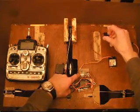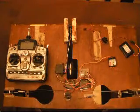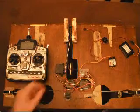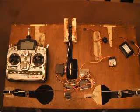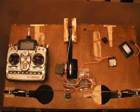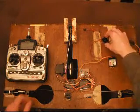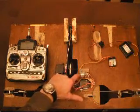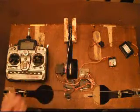To start the setup routine, turn off the power, press the button, turn on the power, and release whilst it's still beeping. To select option one, press the button following the single long beep. I missed it initially, so I had to try again. To select option two, press after two long beeps, and so on. After selecting option one, it beeps to confirm you're there.